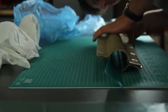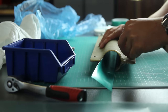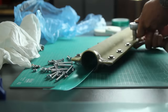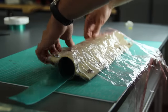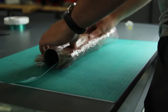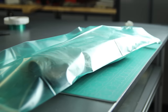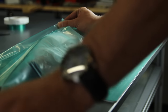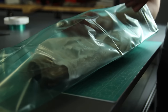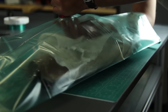I made a small mistake with the dimension of the inner tube — when buying tubes they say for example 50 mm, but this is often the radius, not the diameter. So I'm closing the bag, adding the vacuum port by making a hole through the outer bag. Applying vacuum causes the inner tube to expand and add pressure against the carbon fiber inside the mold.